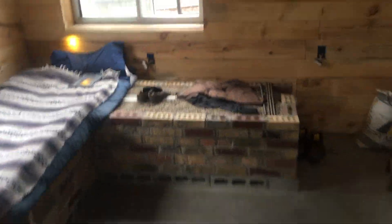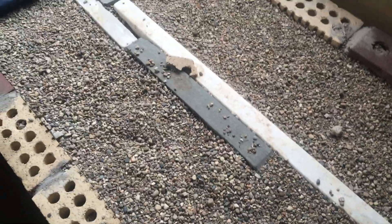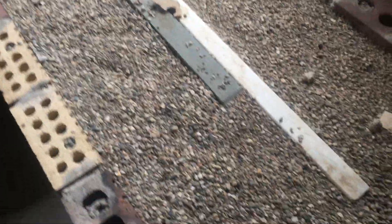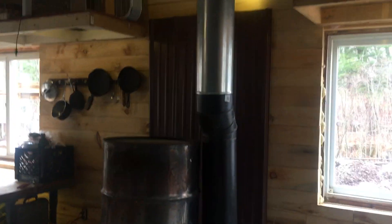It's done amazing. Got it going in mid-February and I've been burning it pretty much daily since — I've gone out of town a few times. I filled it with slabs of granite, sandstone, and marble as the monolithic pieces, then filled in with pea gravel. I'd hoped for cob but you work with what you have access to, and the pea gravel works pretty well. All these are reclaimed bricks down here — it took about a year and a half to get enough bricks to do this whole thing.